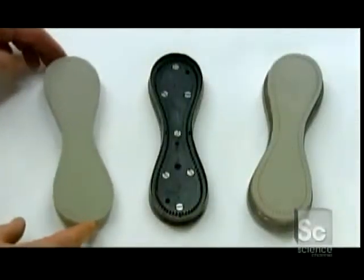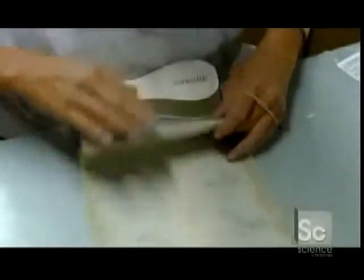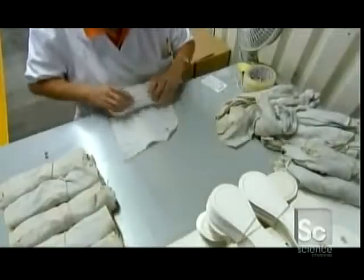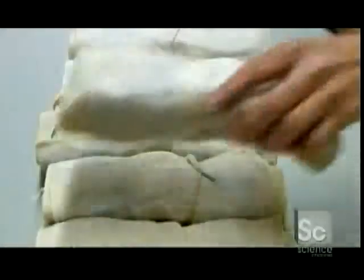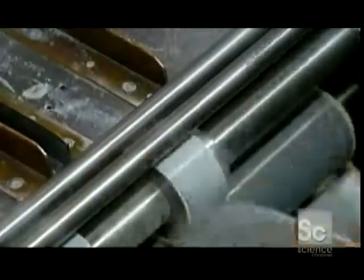Using a hydraulic press, they punch out figure-eight shapes from leather, complete with holes around the periphery, allowing them to be stitched into baseball covers. First, they stamp the date and lot number onto them, then wrap them in wet towels — the moisture makes the leather pliable enough to sew. They roll water-based adhesive onto one side of the cutouts, then press two cutouts to the center's sticky surface. It's an exact fit.